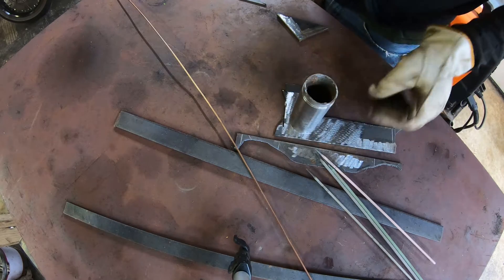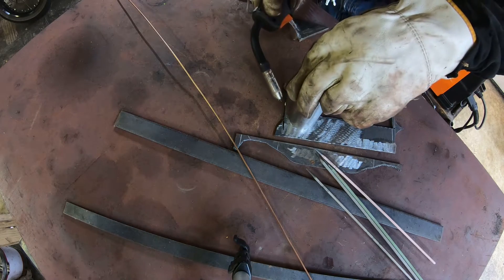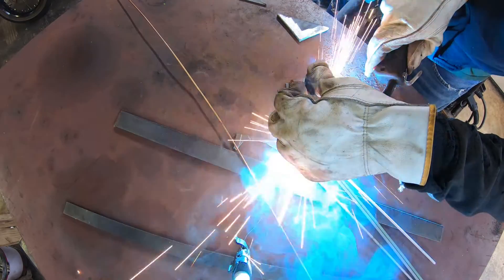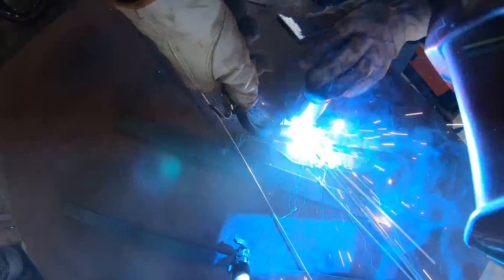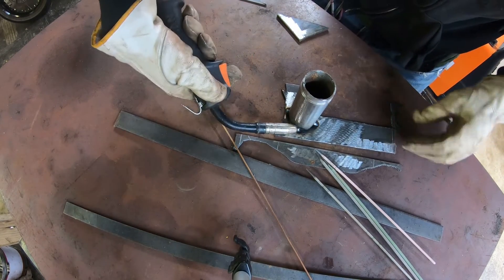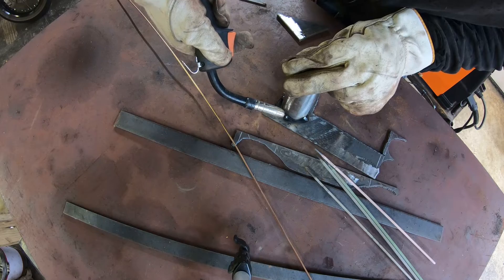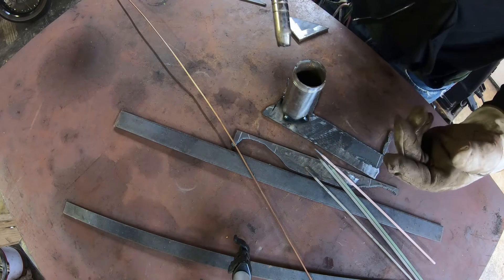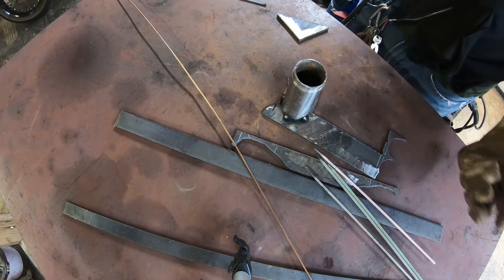The pipe here has been turned, so it's pretty clean. I'm going to go ahead and tack this on here. One of the nice things about MIG welding is that you literally just point and shoot when you're making a tack. You can start up on one piece while you're holding it firmly, pull the trigger and roll it just a little bit forward and back to help make sure that your tack fuses to both sides. It's literally point and shoot — MIG is very easy, great way to start out.